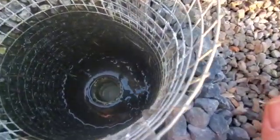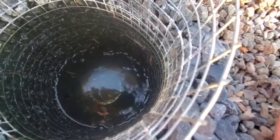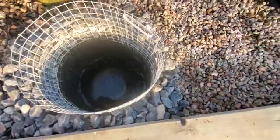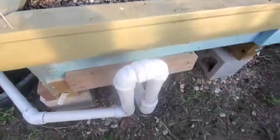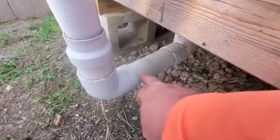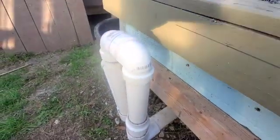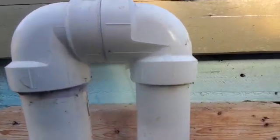It's almost there — there it goes. Water level going down, flow increasing significantly, reaching about maximum flow to empty this out. Unfortunately, the siphon only lasts about thirty seconds. Here's the U-siphon — it starts off with a two-inch diameter pipe and changes to a one-and-a-half-inch pipe at the top of the U-siphon.